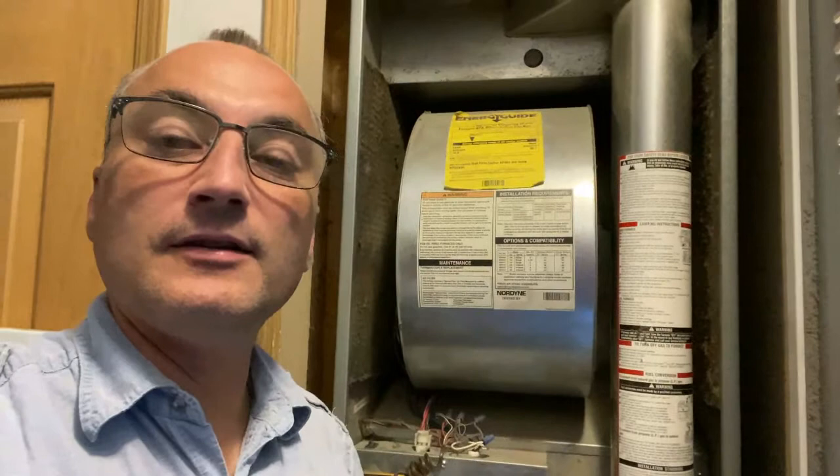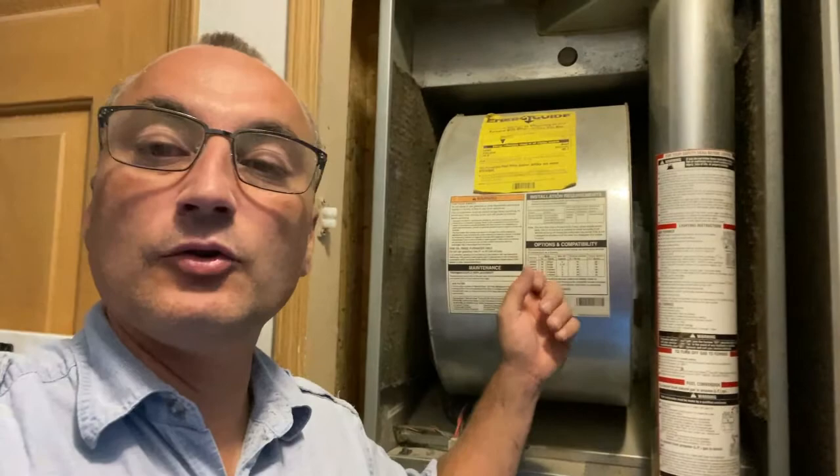You can see it's got a Beckett burner in it. Basically the blower motor overheated and just died because they're running the AC full bore and it's central AC. So I'm going to go ahead and pull that out and put a new motor in it.